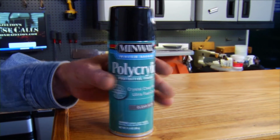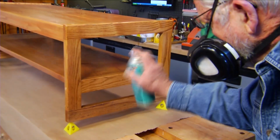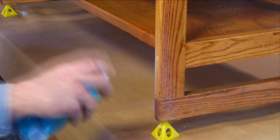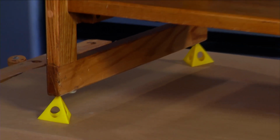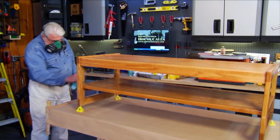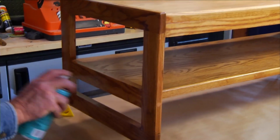This same water-based clear protective finish is also available in aerosol cans, which makes application much faster and easier on more intricate surfaces like furniture legs and spindles. These polypropylene painter's pyramids are designed to support workpieces while they're being finished. The non-stick points make minimum contact and keep objects from sticking to surfaces or paper underneath.